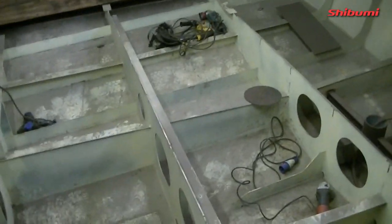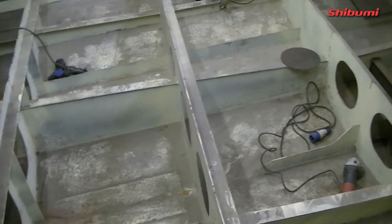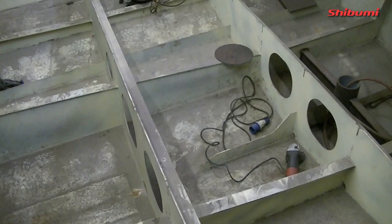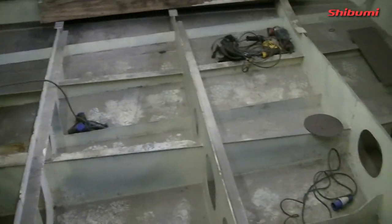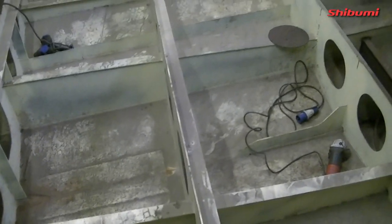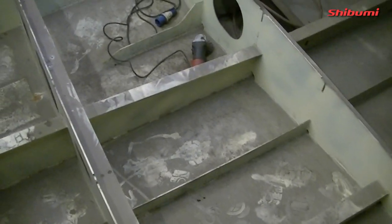We're back in the aft cabin. I hoped to start painting the inside of the engine room and the floor because that's all cleaned out now and the tank is on the ground, but it's been horrible weather — really wet, really damp, not painting conditions. I may have to leave this until spring and re-sand everything just before we do. The paint isn't too bad, but there are bits of rust on the floor I'll have to remove. I'm going to start looking at all the edges the whole way around, sealing those up because they're only welded two inches, then a gap, two inches, then a gap.